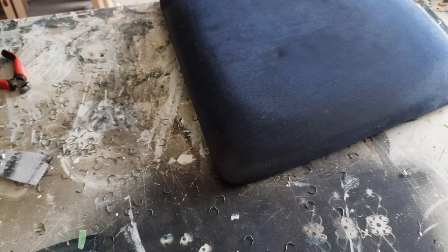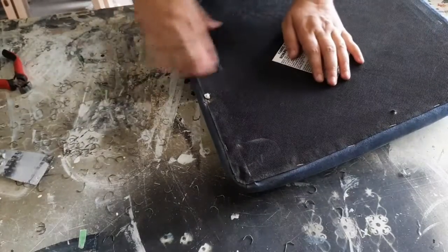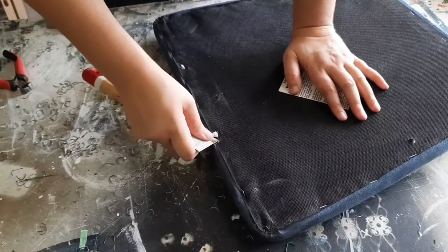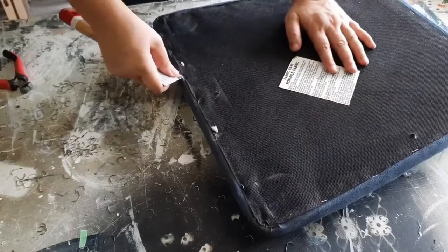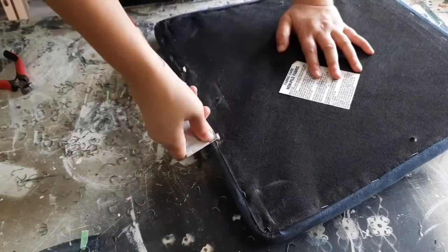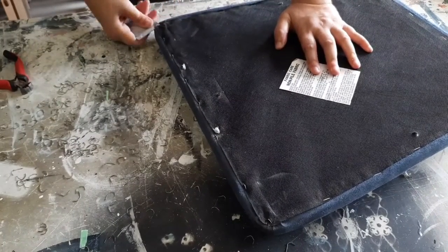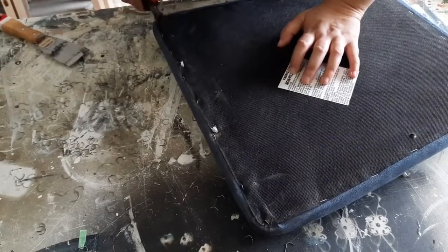The next painful process was to remove all the old fabric and backing off the cushions. I didn't have a staple remover, so I started using a paint scraper — just shoving the corner of it in underneath the staple as best I could and then twisting and wiggling it to pop it up a little bit. Then I used these pliers — I'll find them on the Bunnings website and put the link in the description — I like these for pulling staples and nails because you can rock it backwards and forwards and it does minimal damage.